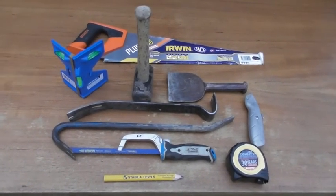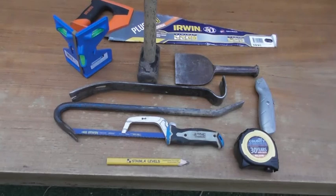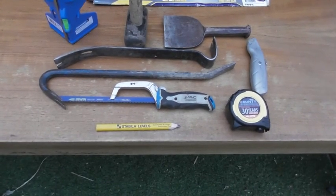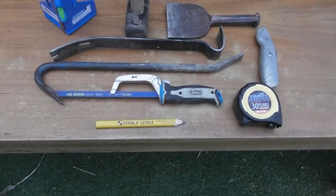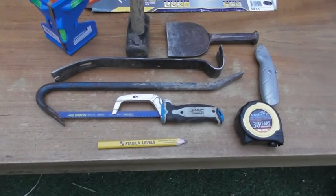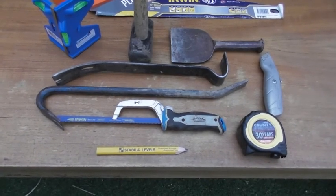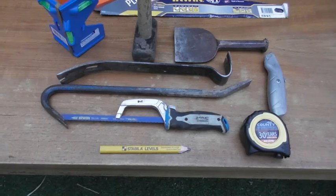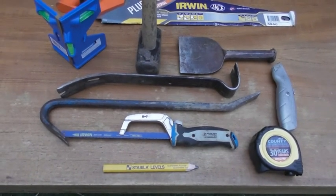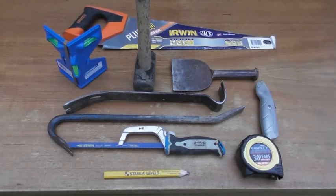There's Mr. Lumpy the lump hammer and the bolster chisel, the big red maroony bladed thing, a couple of wrecking bars and jemmy, a Stanley knife, a decent 8-metre tape measure, a carpenter's pencil, and the handle with a hacksaw blade in it is brilliant because that's useful for cutting nails and screws, so you can cut between the post and the panel through the screw or nail, and it saves damaging the panel or post if you want to retain it for further use, which doesn't happen so delicately with the wrecking bar, jemmy or bolster and Mr. Lumpy.